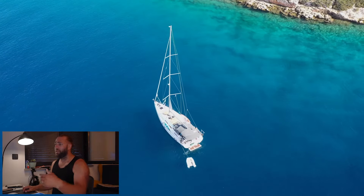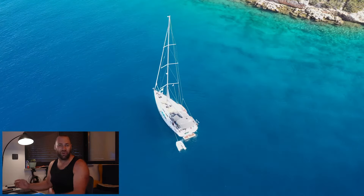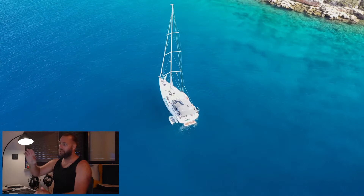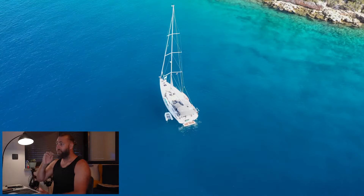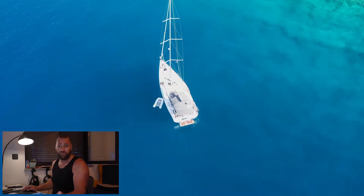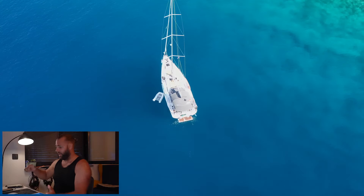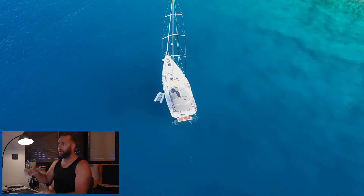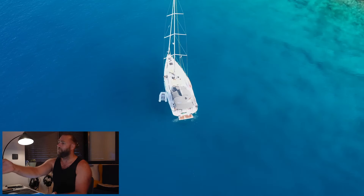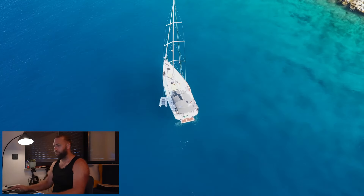Mahina's come to the port quarter and she's picking up the dinghy painter. This is really important — reduce the amount of things that can go wrong whenever you're doing a maneuver: docking, refueling, all of this. She's going to bring that up to the midships cleat. If you don't have a midships cleat, tie it to the bow cleat or the stanchion at midships, because you don't want a line catching in your prop. When tied at midships, if we go in reverse the dinghy will just float forward and rest against the boat.